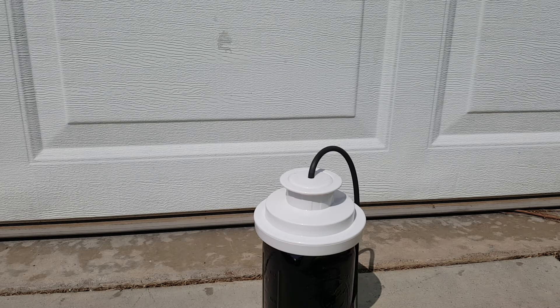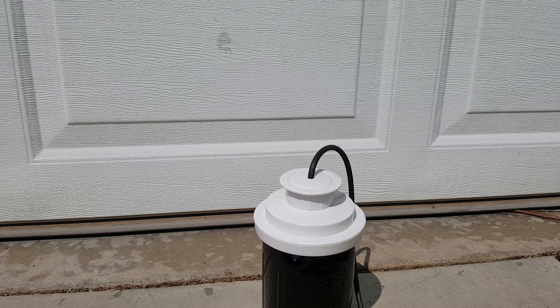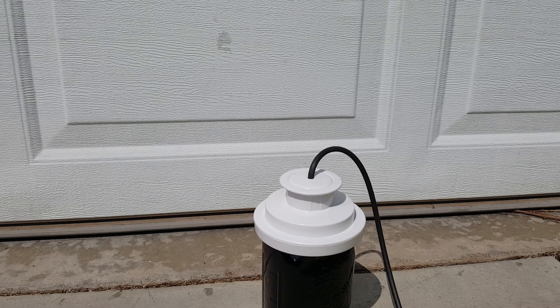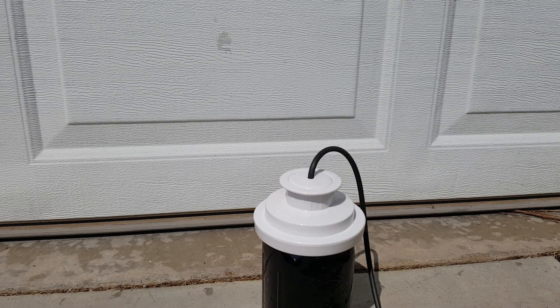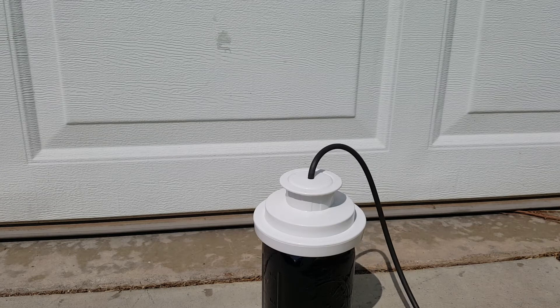Lots of people talk about doing this. I bought a transfer pump they had — way cheaper. The thing is, this is made out of brass, and brass actually has lead in it, so you're not supposed to use this for food and beverage. One thing no one says is that since you're pulling air, I don't see what difference it makes — still not ideal. You attach the hose to this end, and this attachment's from the brake bleeder kit and the other hose is from the transfer kit. That little tip doesn't stay in the jar adapter.